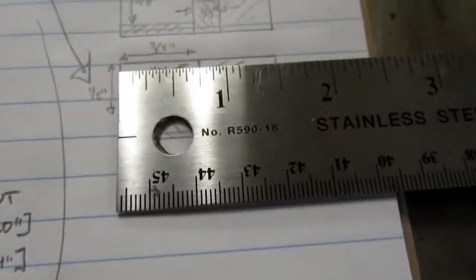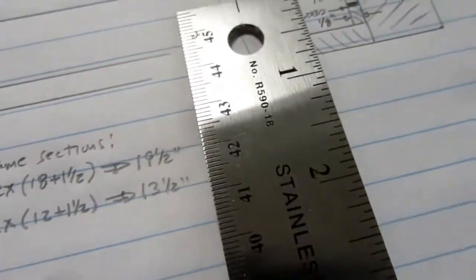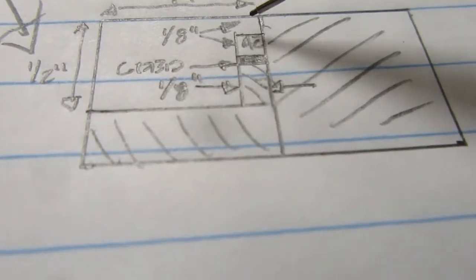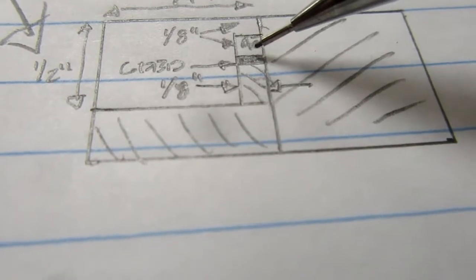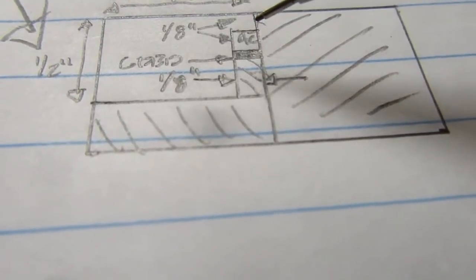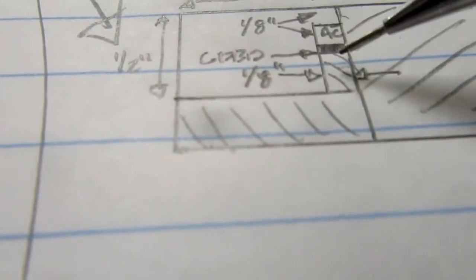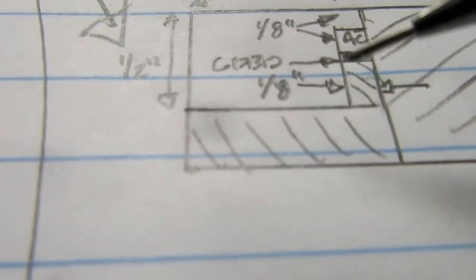For the smaller frame, it's going to be 1/2 inch by 3/4, meaning 3/4 inches wide and 1/2 inch deep out from the wall. Because the picture doesn't have a margin to it, I'm going to have only the minimal 1/8 of an inch overhang on the inlay, and it'll also be 1/8 inch deep. Then the 1/8 inch acrylic, this one will just be backed up with some poster board instead of masonite. It's a much smaller picture, so that'll fit in there, and that'll still give me plenty of room to anchor the stack inside the frame. So the 1/2 inch here will work.